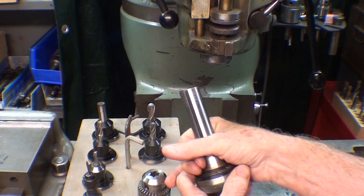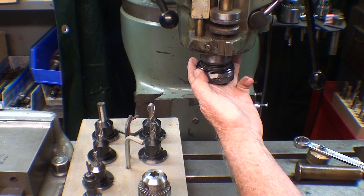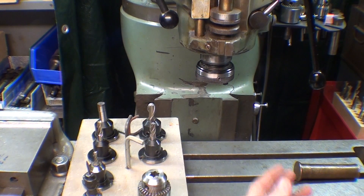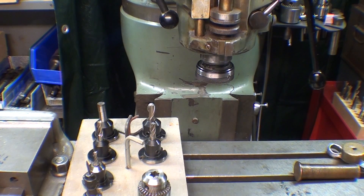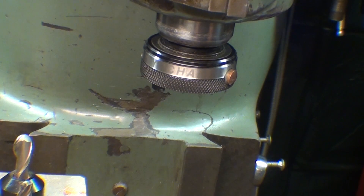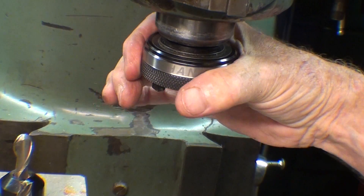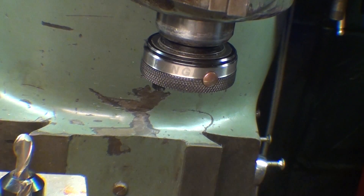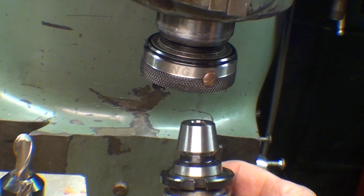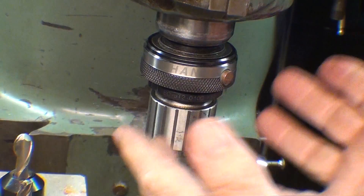The R8 shank Easy Change Body, of course — wipe it off, oil it once in a while. Put that right up in your spindle and tighten it down as you would any tooling. And then if you're using strictly royal tooling, it may remain there for months, depending on how many adapters you have. That's tight and ready to go. Before you attempt to put your holder in there, you need to cock this if it's not already cocked. So with my foot on the brake, notice the brass plunger there and a knurl — I'm just twisting that. And now it's cocked and ready to receive the holder. Then I'll simply put this in, make sure that they're clean, no chips on them, stick it in there, rotate it, and you'll hear it click and move slightly. And it's ready to use.